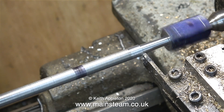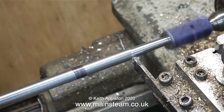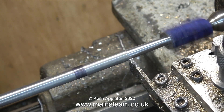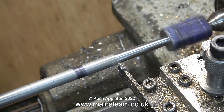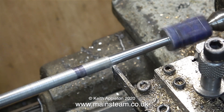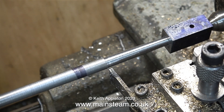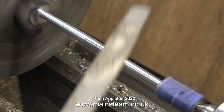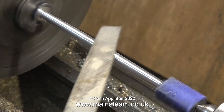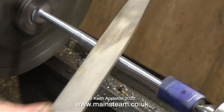So why two degrees? Well, I think this is possibly a metric lathe, so maybe the degrees are metric degrees — I really don't know. There'll be 360 of them all the way around the top slide. Here's a top tip: rotate the top slide one degree at a time and you will eventually get the right taper. Also make sure that the early cuts are very fine indeed. Do you remember why I turned the entire shaft to one imperial drill size above five sixteenths? Well, here's the reason: I'm filing the center section using a very coarse file so that it matches the tapers on both ends.